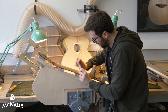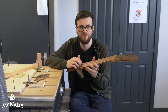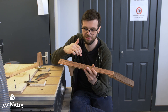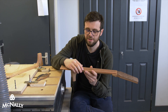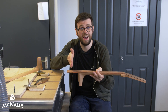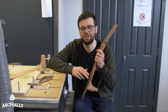One of the parts where the CNC really excels is the fretboard. As most people know, the location of the frets is really paramount to how in tune the guitar sounds and plays. Being able to use the 0.1 millimeter accuracy of a CNC — in this case with a 0.6 millimeter cutter to cut these slots — really does improve the guitar. You have to ask yourself as a customer: are you okay with that, or do you absolutely want a guitar maker sitting doing this by hand with a saw? I used to do that and it can work perfectly well, but when this technology is available it makes sense to use it.